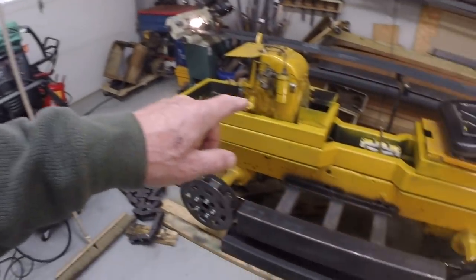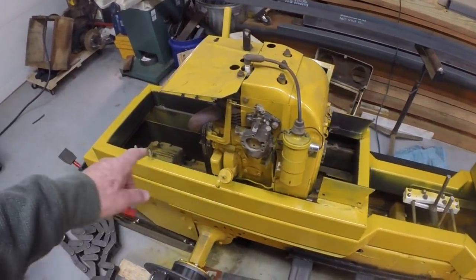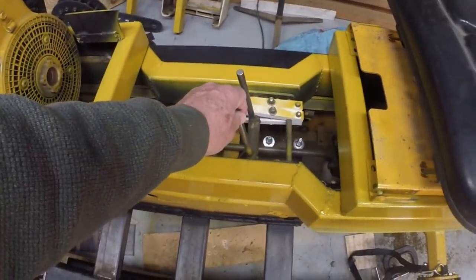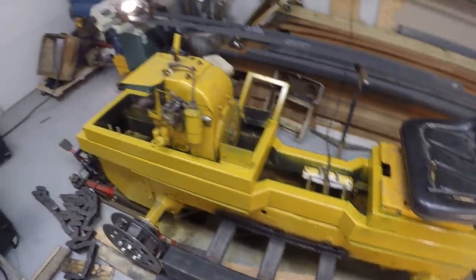as it might stretch. The rest of the frame here is a 14 horsepower Kohler single cylinder engine. There's two hydrostatic transmissions. There's one here, there's one in the rear, and the controls for them are here, one for the left track and one for the right track. And each transmission is infinitely variable forward and reverse. So you can operate one track forward, another track in reverse, both forward, both reverse, whatever you choose to do.